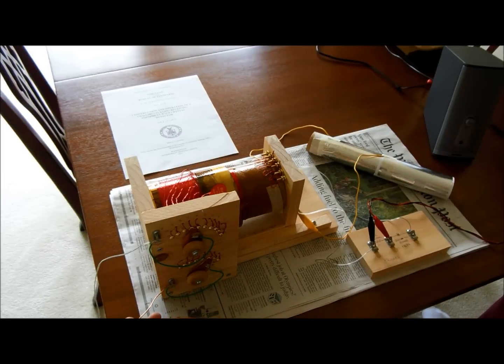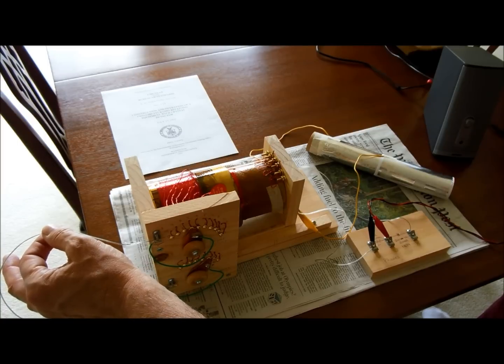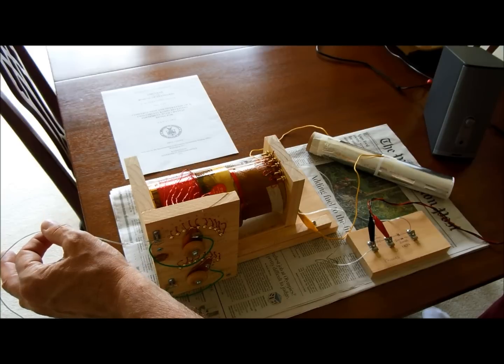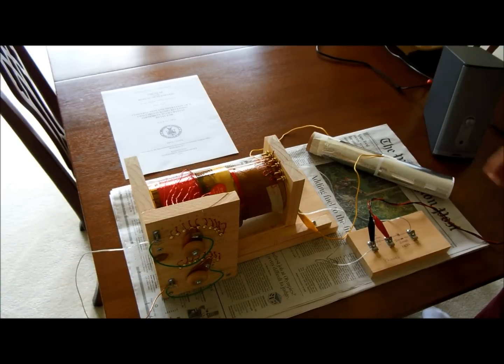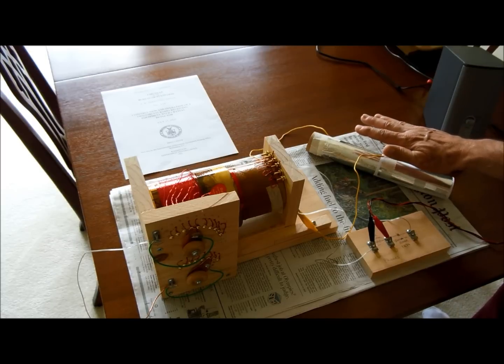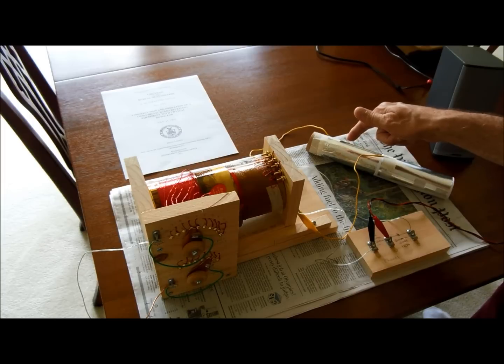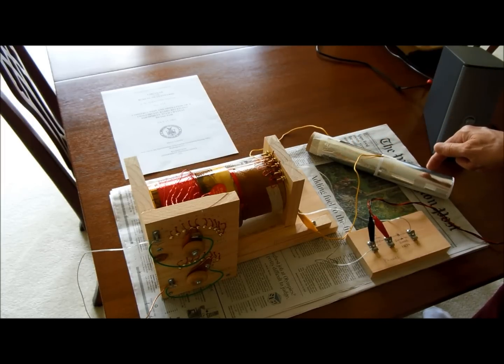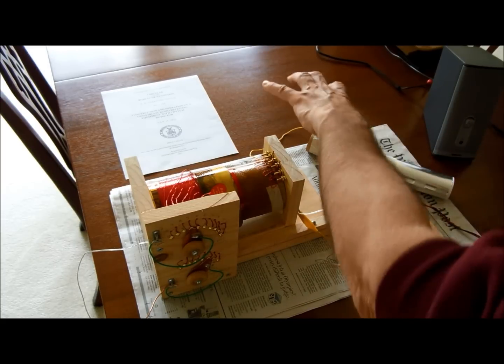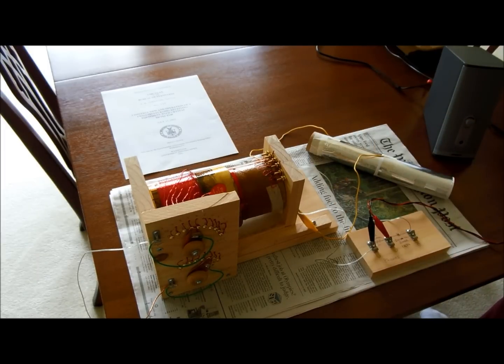You've got an antenna coming in, and it's important to have a ground — I have this connected to the electrical ground in my house. Radios also have a capacitor that's used to help tune them. This capacitor I made out of a paper towel roll with a piece of aluminum foil on it, and then this is just a piece of computer printer paper wrapped around it with some more foil. By sliding these two tubes in and out, you can change the amount of capacitance.